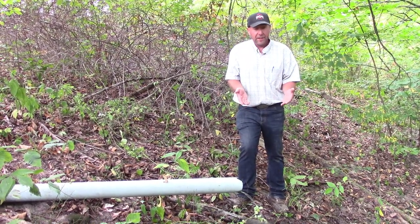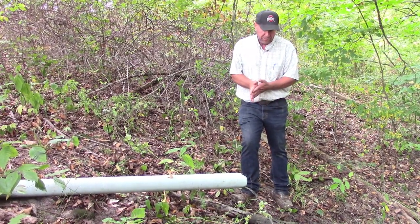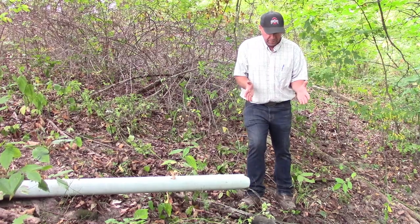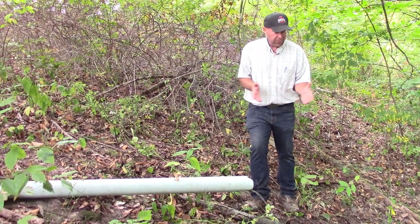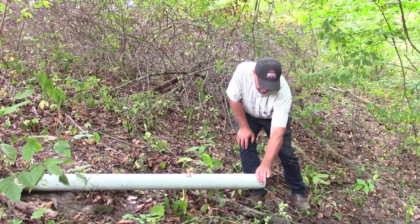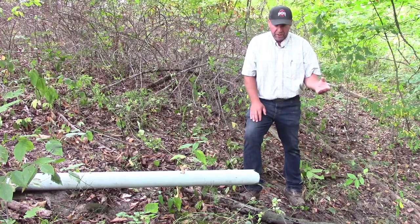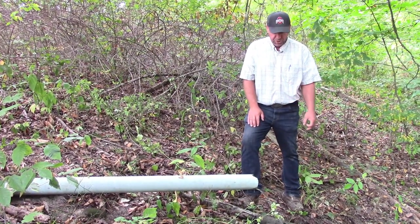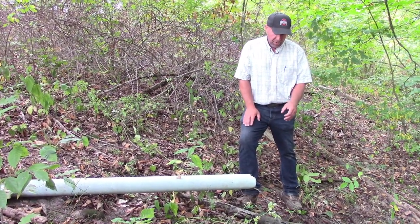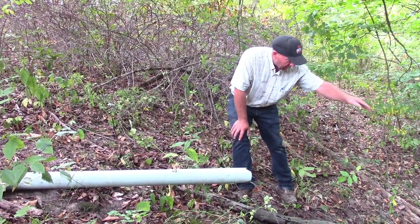If we've got other livestock somewhere that need water, we're letting it go down the creek. What we would do here to collect this water is get what's called a Fernco fitting, put it over the edge of this pipe, and neck that down to an inch-and-a-quarter or one-inch pipe. We've got the fittings and we'll show all that in another video — we'd neck it down to a polyethylene type pipe.